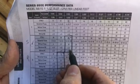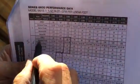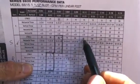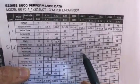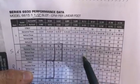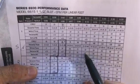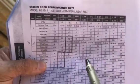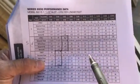If you go up to 90 CFMs and hit it with a six-inch flex, you're not guaranteed to stay quiet — you may get more horizontal or vertical throw, but then you're talking about making noise. Linear diffusers work fantastically as long as you can't hear them. So when you go into custom homes or commercial buildings, listen for any noise. If you hear anything, you don't have your louvers open correctly or it isn't set up right.